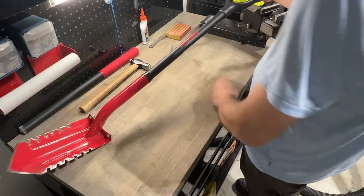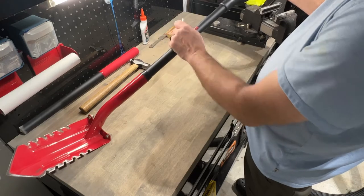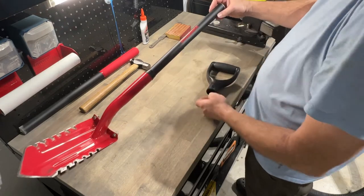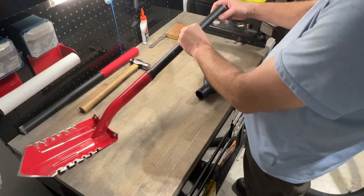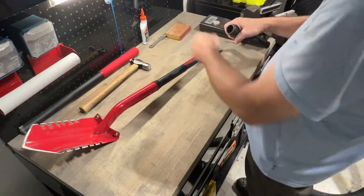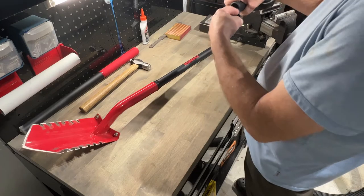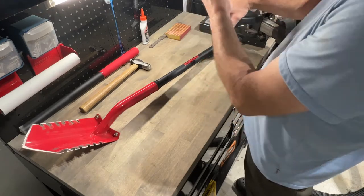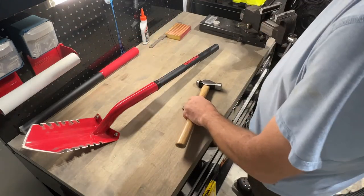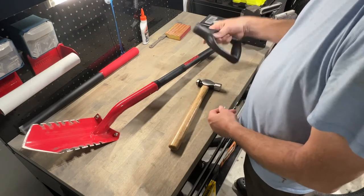Pound this down. Drill holes in it, and that's what this pin is for. You notice the pin is not threaded. I'll sand. Measure the depth of the handle. I'll scuff the paint on the handle here. I'll take like a file or something, scuff the inside of the handle. I'll put it in place, drill the hole through it, take it out, I'm gonna glue it, put it back in, drop the pin through it, and then I'm gonna peen, take a hammer, a piece of steel or something hard underneath my vise, and then I'm gonna peen it over, and that'll hold it in.